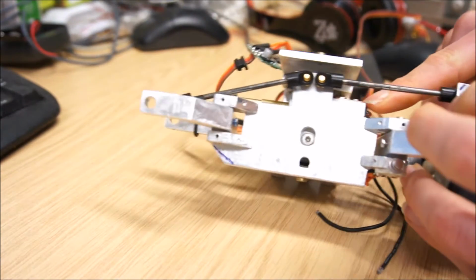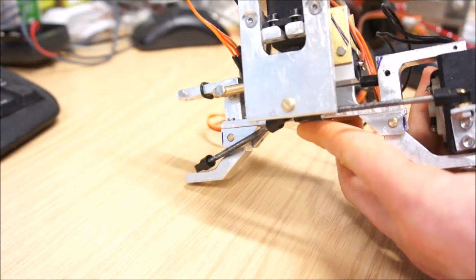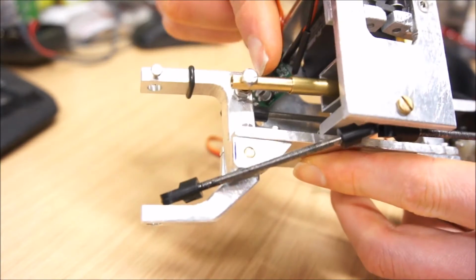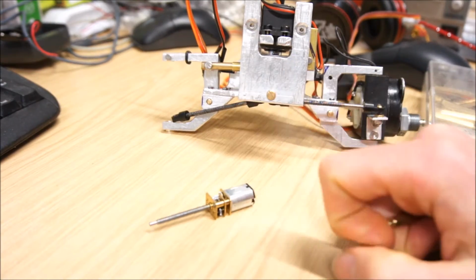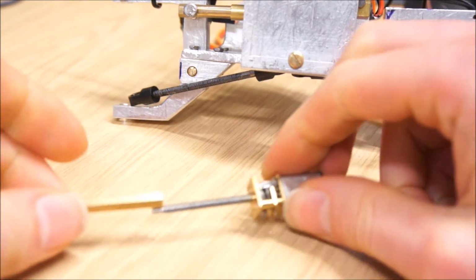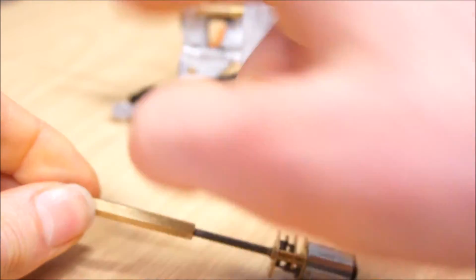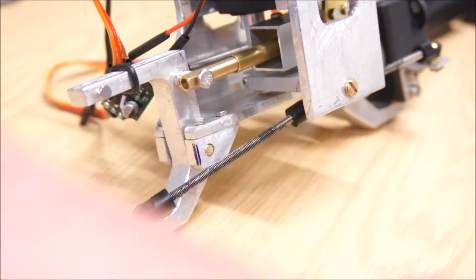So we have in here a tiny gear motor, first pivot point, second pivot point, and this brass sleeve has a female thread, and this brass tube is just a dust jacket, so this is only protective. So I have one of these, and one of those M3 brass standoffs, and you can imagine if that rotates and that is fixed, as it is here, then I have a very compact lead screw arrangement, and that's exactly what I did.